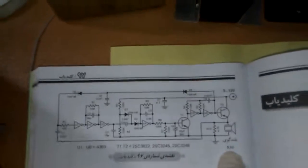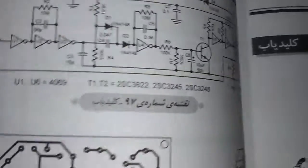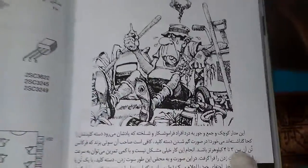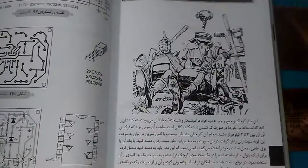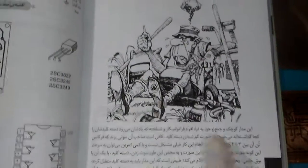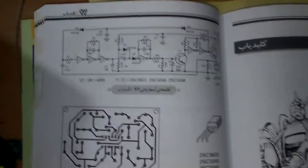The whistle signal comes to the piezo element. Everything is easy to make. To explain how it works: a whistle in the range of 3 to 4 kilohertz will activate the oscillator part, and the oscillator will then play a song so you can remember exactly where the key is located.